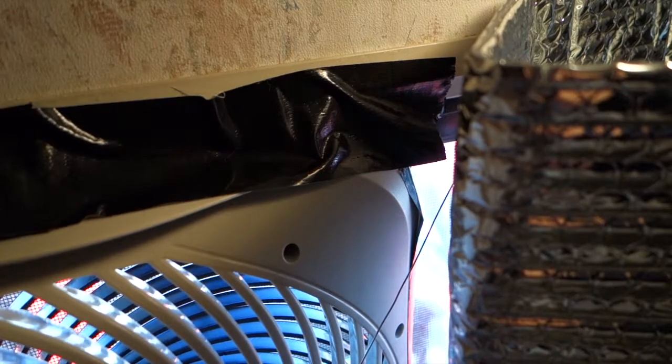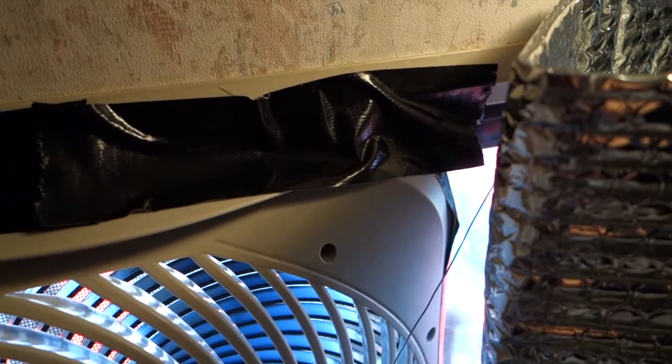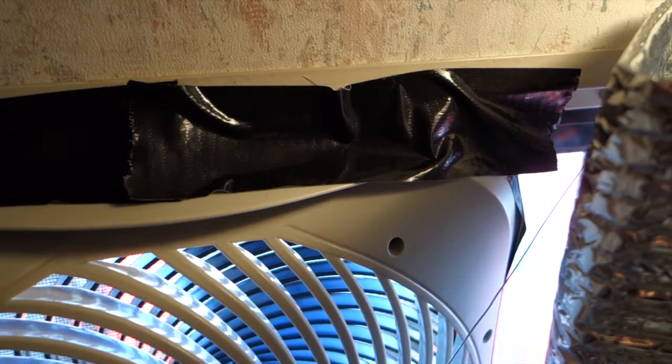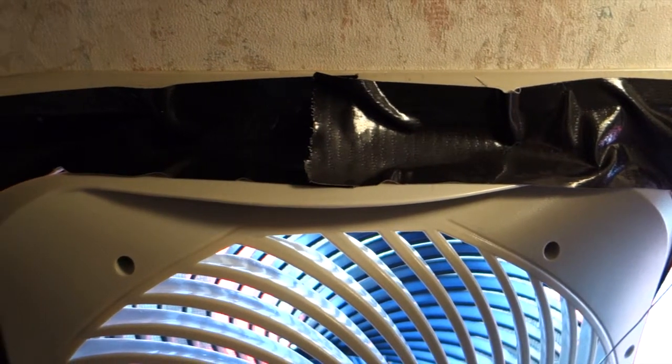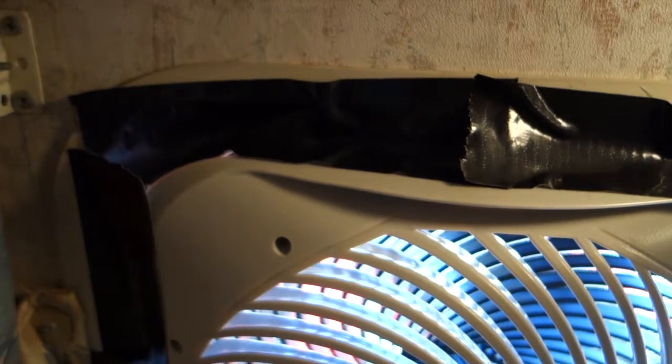One thing that's really important when mounting a fan that's blowing air outward is to maintain a decent air seal around where the fan meets the window. I found some duct tape works well for this — it has near-zero insulation properties, but it does block drafts of air. It's like using a windbreaker jacket compared to a down jacket; it's going to block most of the airflow gap.